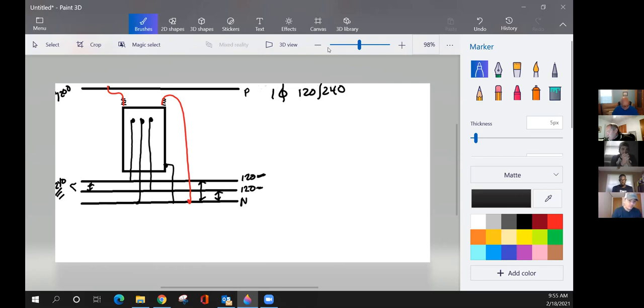Very good. Now, if you've got any questions about this single phase connection? Yeah, I do, just because of the video you showed earlier. As far as your red line that goes to the neutral, how does that work on a single bushing transformer? Yeah, so we're going to take that bushing away and take that red line away. Now, what happens on a single bushing transformer? Where is that line coming from? On the single bushing, it travels inside the tank, of course, through your windings. It's going to go through all your little windings, and then it's going to come down, and the end of it is going to connect at this point right here on the tank. Any kind of tank connection, that's where it's going to end up.